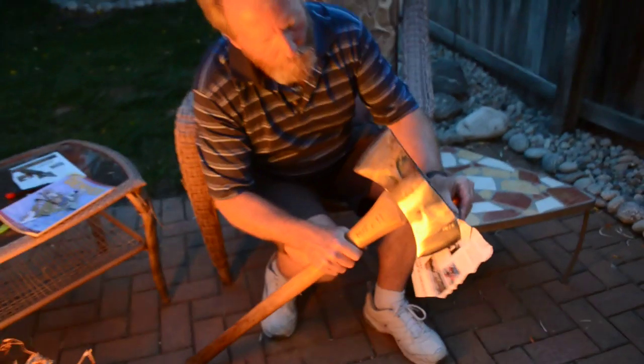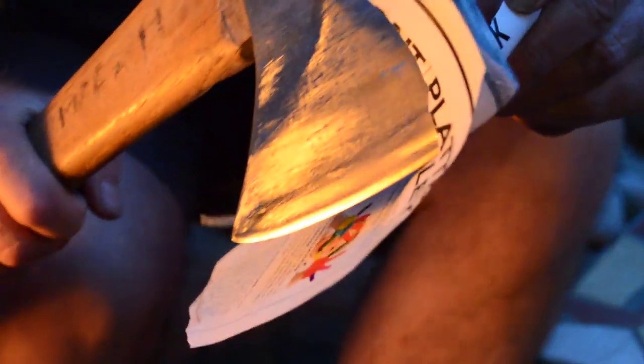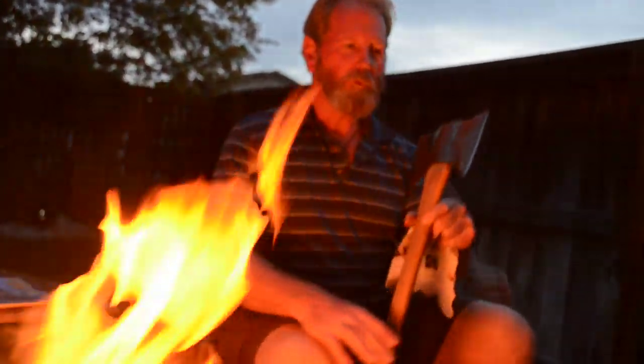All right, before the paper turns away from me. Let's make this just a little bit stiffer so that I can actually make the axe go on down through there. If you can go out there and tease that along that far out — that's pretty darn sharp. So I re-profiled it, made it thinner, drew the cutting edge back further. It's not as thick as this side is. That's the axe I've been working on. And who knows — if I have some down time, I may re-profile it again, come back a little ways, thin it a little more, polish it a little bit more, and actually make it sharper and smoother so that it goes deeper into the wood with every cut. So that's the axe.